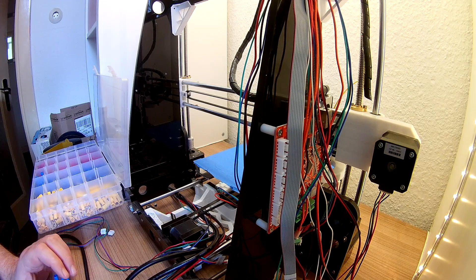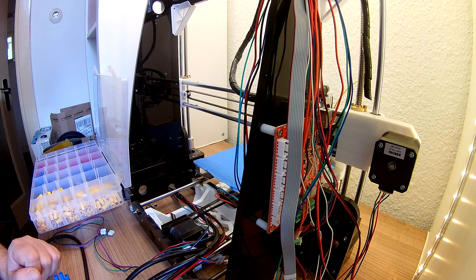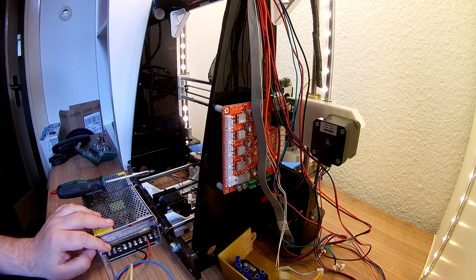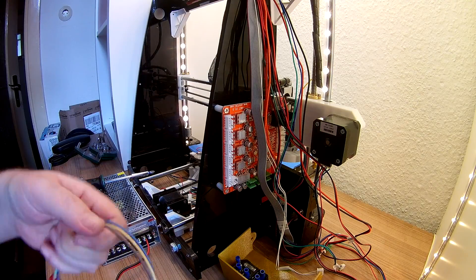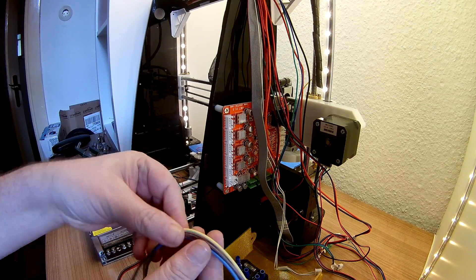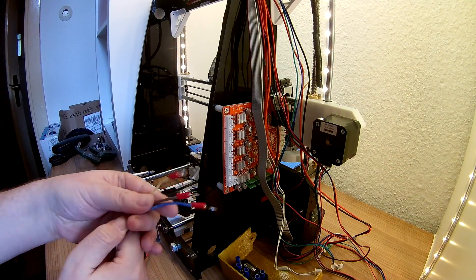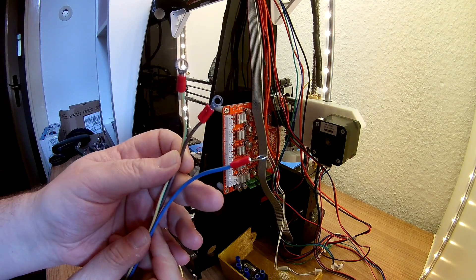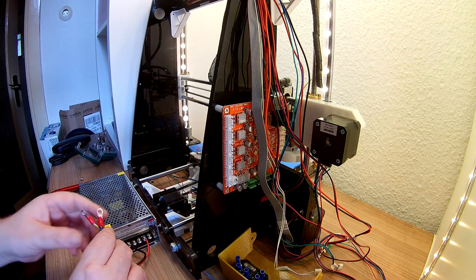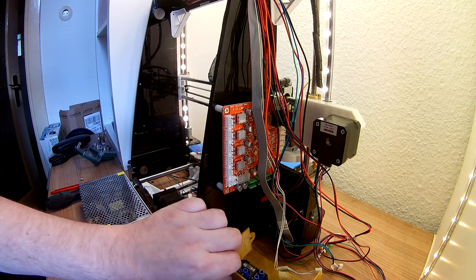Next I'll disassemble everything further and disconnect the power supply from the cable, so I can put this down here to work. Now I have the black cable, which was previously the power cable, removed here and cut off a piece. I remove the black covering. I then have three cables — phase, neutral, protective — all provided with cable lugs. With the red ones, the size was perfect for these screws. These are now screwed again. Then I have to cut the length so that it is enough to connect everything.